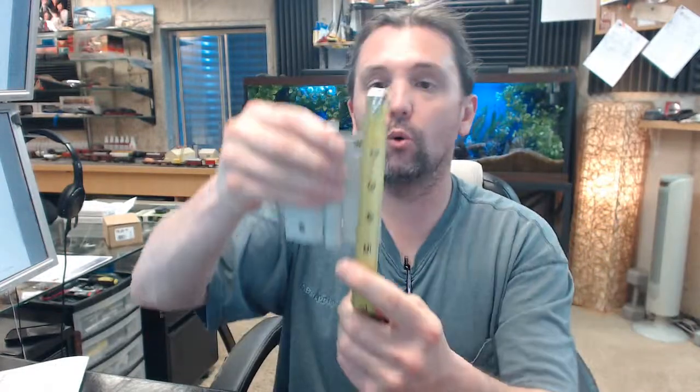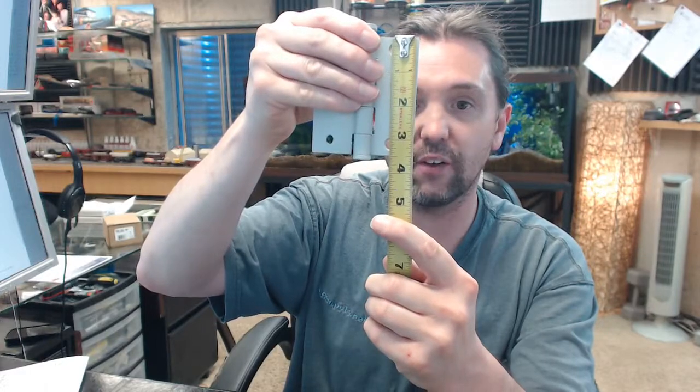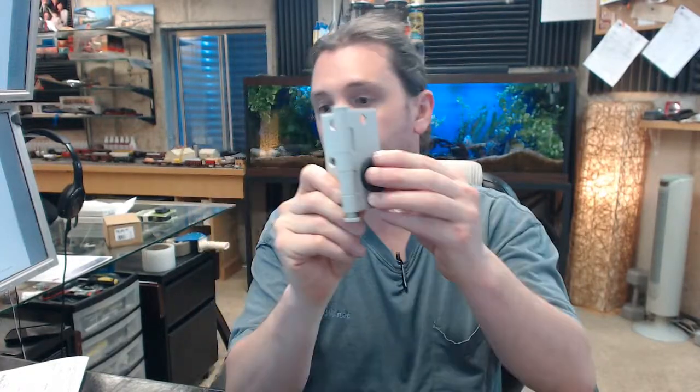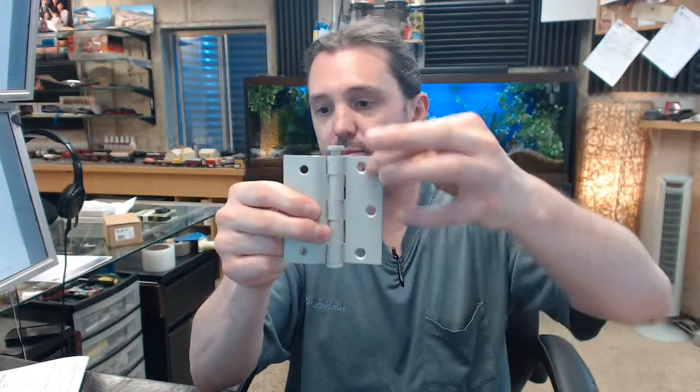It's a steel hinge. Let's dissect the part number. 5300 means it's half surface, and it's steel based. 035 is a reference to the height. This is a 3.5 inch hinge. The 600 means prime coat, but it also means steel based. These screw holes are considered template, very typical and common.